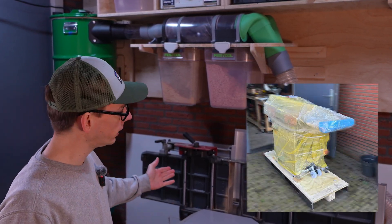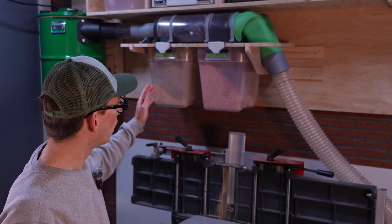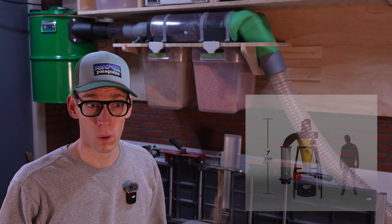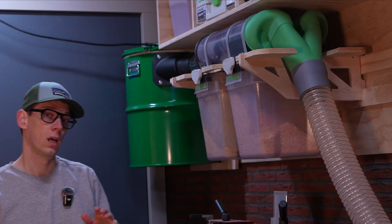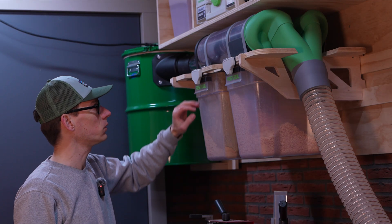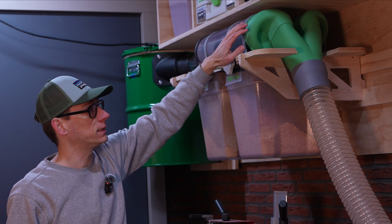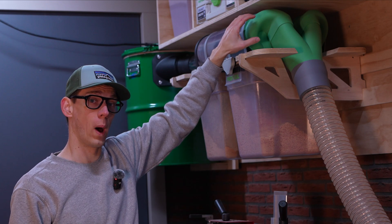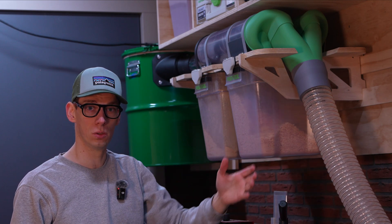It's exactly one year ago that I ordered my way too big planer for this tiny workshop. I built my own overhead dust separator for it, because commercial systems were way too big, or I hadn't the money to buy them. I completely redesigned the centrifugal dust separator made by Filzink Gitaars, made it more efficient, and added some cyclonic inlets to it, so it eliminates the need for the Y pieces and a 90 degree bend for the flex hose to go to the planer.